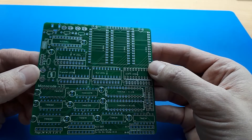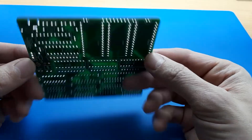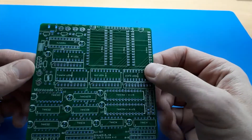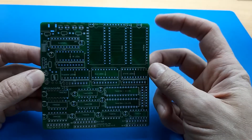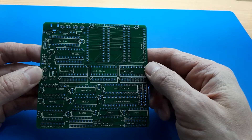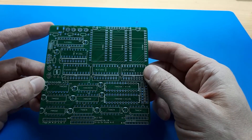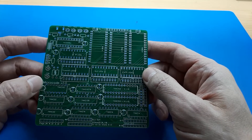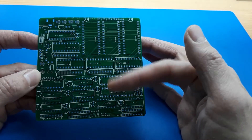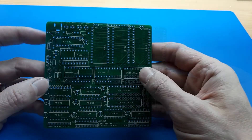Getting this many components onto a board means the auto-router had quite a problem routing the tracks. I always use the auto-router — I place the components, do my favored rounded corner style, position everything, run auto-route, and it got to about 98% and stuck. Tried again, got to about 98% and stuck. I had to move bits and pieces around at random and try again until it eventually worked.